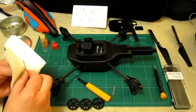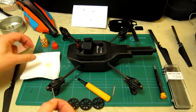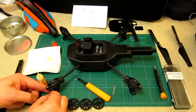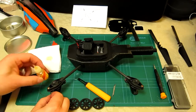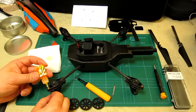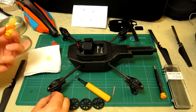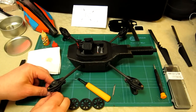I'm oiling the shaft pin all around to make sure it's covered. I'm also adding a little bit of extra oil so when I feed this pin through, before I go all the way, I'm adding another drop of bearing oil into this reservoir I've basically made. Trying to get one drop — it just went back up into the bottle — there we go, there's one drop. A little bit more than I expected; I think I perhaps had got the drop and didn't realize it.